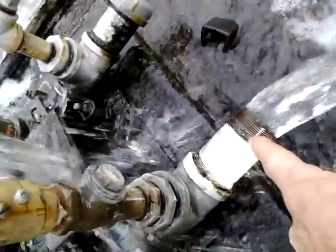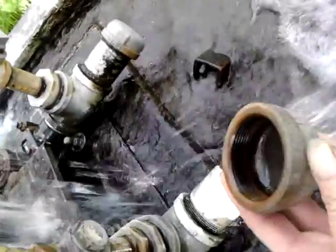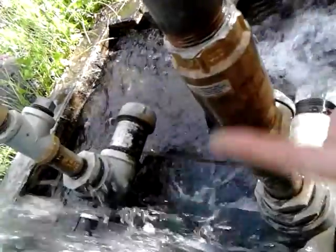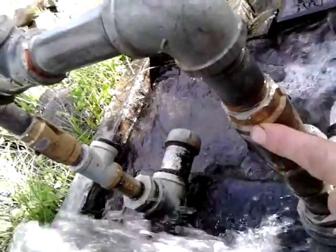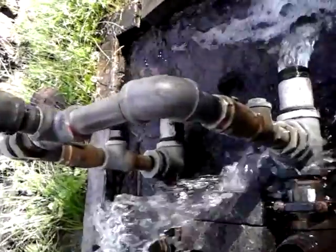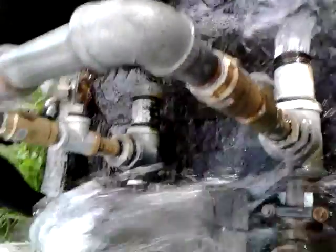These caps I replace right here — I screw these caps on, and that's what shuts them off in the wintertime. In summertime, I leave it running all the time. These valves right here are the ones that the water sits on top of in the wintertime, because you can't drain it all out of the whole system, and that water will break that valve. Home Depot just changed the price to $20 — they just doubled it.